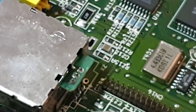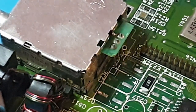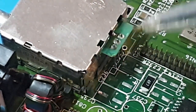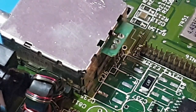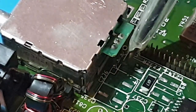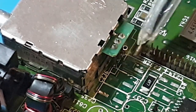So I've got to sort these wires out, as I said, up across the top of the board. RF box. Unfortunately, these boards are that old and these pads are that delicate that these things happen. There's nothing much that we can actually do to stop that, really. I mean, a heat gun is a way forward. But as I said, I've gone in the back of here first, warmed that pad, lifted it this way.